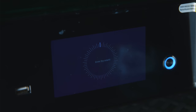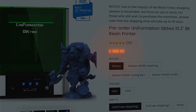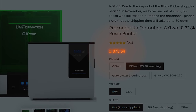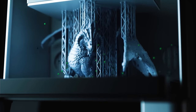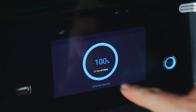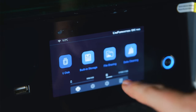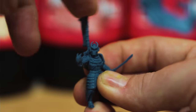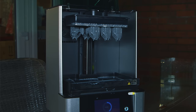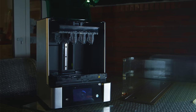Guy has the Uniformation GK2, which is an incredible 3D printer — in fact, it's the best all-round 3D printer on the market right now. It has a chamber heater, which helps enormously, because resin temperature plays a role in resin printing. When resin is warm it cures faster, and depending on your resin there is an optimal range which is normally above 20 degrees Celsius, with mid-20s ideally. You can cure resin in lower temperatures but you'll need to cure it for longer, which often results in overexposed or more brittle prints. Unless you have optimal temperatures, you won't get the most optimal results.